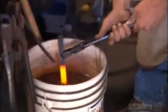He heats the bar until the middle is white hot. He brushes off any dirt, then dips the bar in water to cool it. Then he hammers the ends to redistribute the metal towards the middle. This widens and thickens the part of the horseshoe that gets the most wear, since the front of the hoof hits the ground first and hardest.